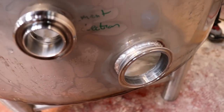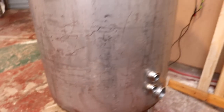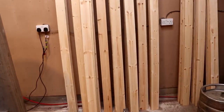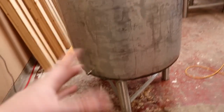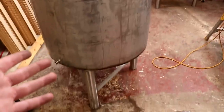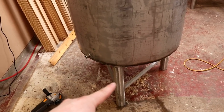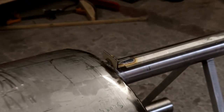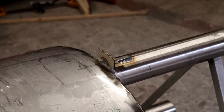Around the camlock bosses and stuff like that — all nicely finished. So now it's time to start wrapping this in insulation and putting some hangers on to put some timber on. The question is how do we mount the timber onto the tank so it's not just falling straight on the floor? I've made some brackets to attach to the legs. We pull it back into the shop for one more bit of work on the base. With the other tanks we can just sit pieces of timber on top of the legs and band it on, but this one needs brackets. Quick as a flash, the brackets are welded on — let's go see if they work.